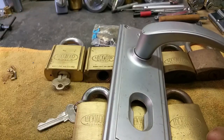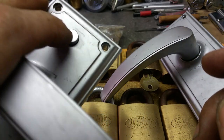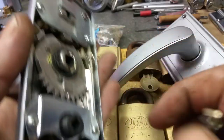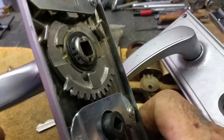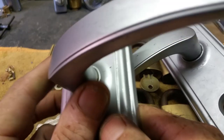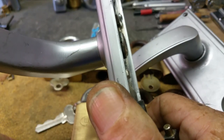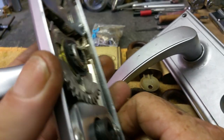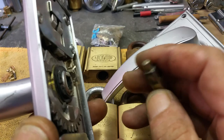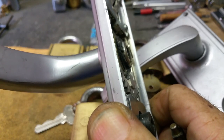It's a pretty straightforward fix, but I've gone over this with Gainsborough - I don't use them, don't recommend them, don't fit them. I'll repair them if I can and have the parts, but these are about $220 at Bunnings; my price is about $178. Overpriced in my book. They're notorious for breaking down, especially the internal hub assembly with the latch, and you can't get parts from Gainsborough - their attitude is tough luck, buy a new lock.